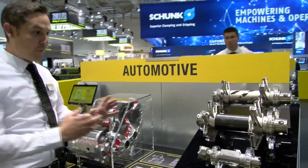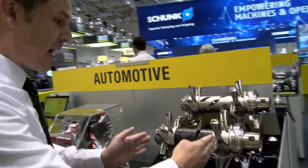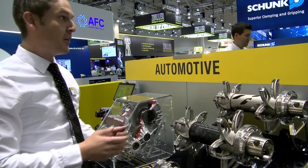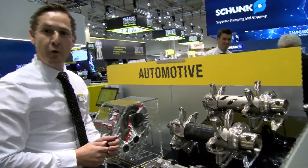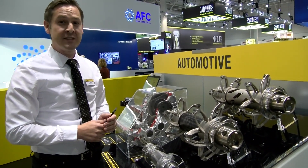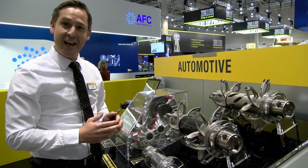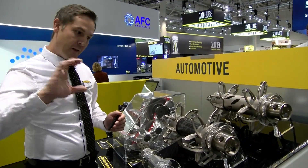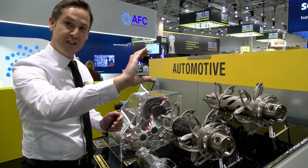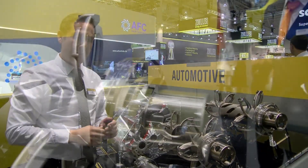Imagine a tool of that size here — remember, you have big diameters and large depth. If you imagine this tool being made from steel the traditional way, it would have maybe 25 kilograms; if you reduce as much weight as possible, maybe 20 kilograms or somewhere below 20 kilograms. The main challenge here is the machine tool grippers — the automatic tool changers cannot handle it. They take it out from the magazine, carry it to the machine spindle, put it in, and due to the weight and especially the tilting moment, they cannot handle it anymore.